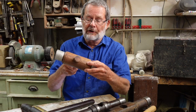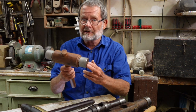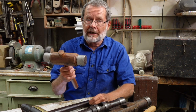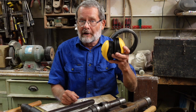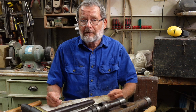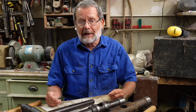European mallets generally don't have this feature, but there's still a distinctive sound when you've hardened up properly. I think the feel of the iron on the cotton is more important than the sound, although both are important. Whatever type you use, ear protection is important — some mallets are louder than others, but all are loud enough to require it. If you've only got a little bit of caulking to do, you can get away with any wooden mallet, but most are too light and you have to hit harder, and the action is actually more tiring than using a slightly heavier mallet.